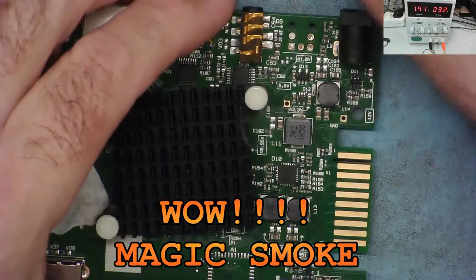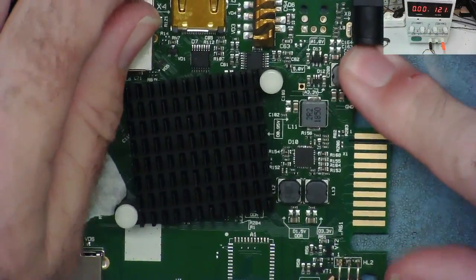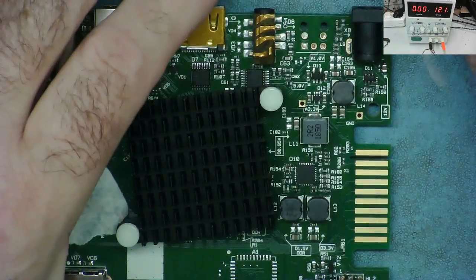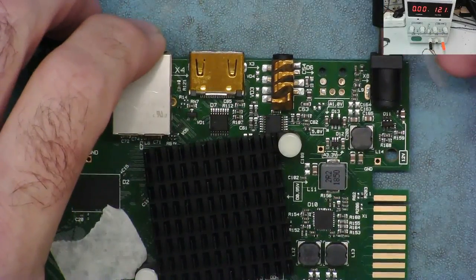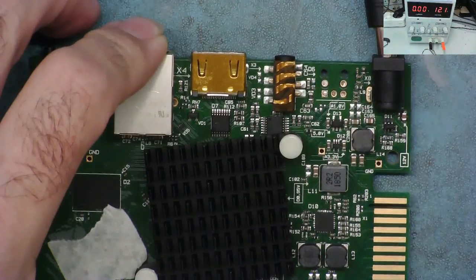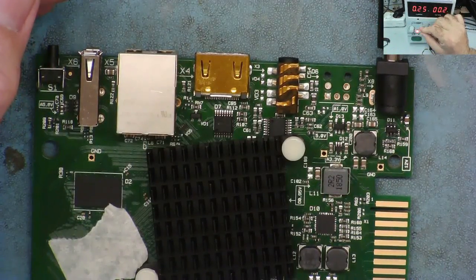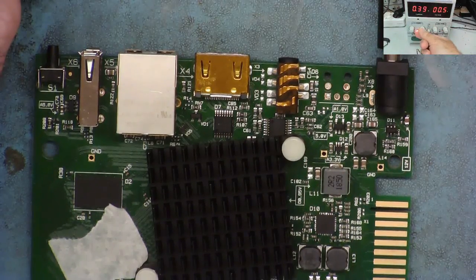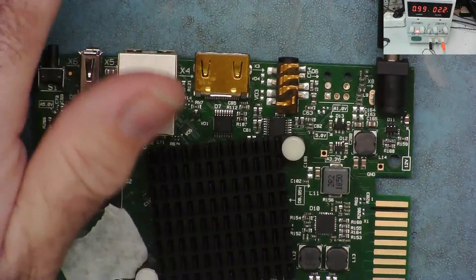Okay, it's definitely going to short circuit somewhere. Just disconnected. Something somewhere, once it is powering up, is effectively acting as a short. And at that current, something's going to get hot. See where the problem is? I'll do another way. I'll turn the current down, actually. And now let's just turn the current up so it's drawing maybe an amp. Yeah. Now is something getting hot?